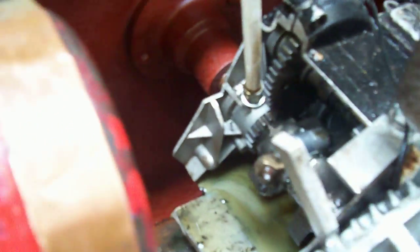The main bearings are oiled from these oilers — I will be replacing them when funds allow. The bore is lubricated through simply a hole through the valve chamber, filled with oil. The inlet valve is atmospheric rather than run off the cam, but the exhaust valve is still how it should be.